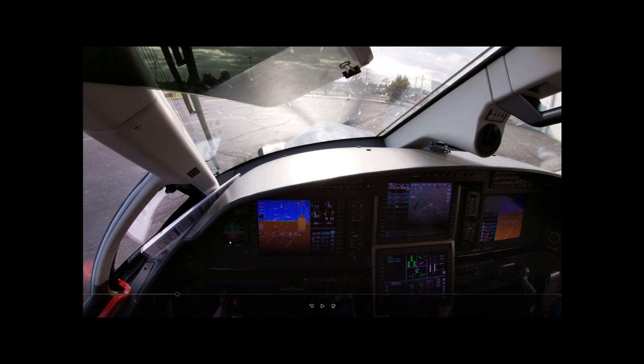As you can see from the picture, this is a standby attitude indicator, airspeed indicator, and altimeter that you set separately from the Honeywell system. It will also power CPCS Channel 1 — the cabin pressure control system, which is dual channel, but one channel is enough to give you pressurization control. And the last item on that bus, other than the EPS out, is the supplemental oxygen system, so we're still going to have oxygen if we lose pressurization for any reason.